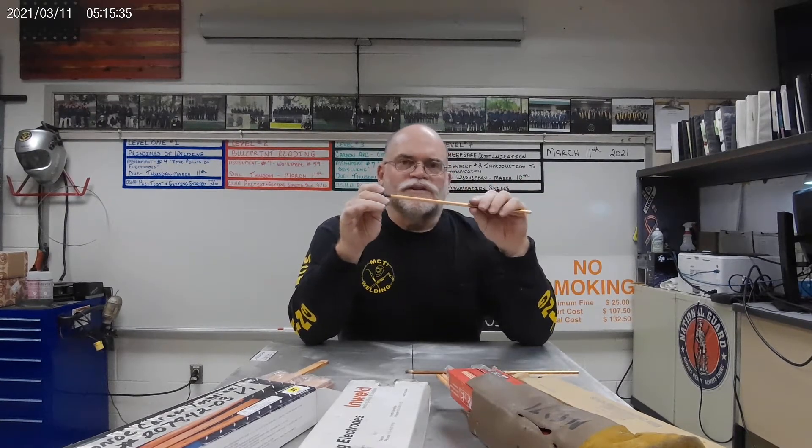This is a quarter-inch rod — still copper on the outside but with a carbon tip. This would give you about a quarter-inch wide swath of material or weld removed. Of course, you're going to need a little more power: 250 to 300 amps along those lines.